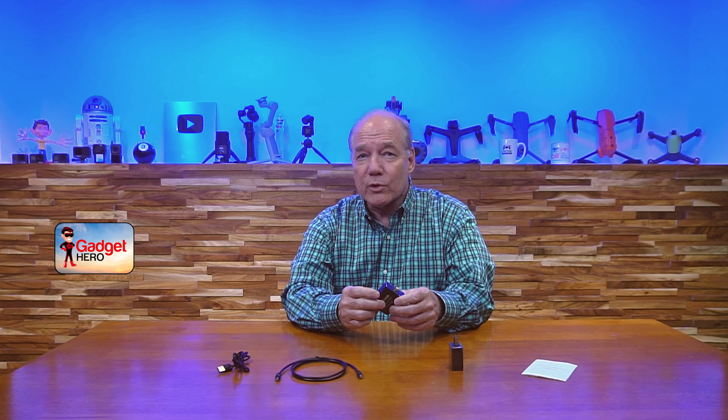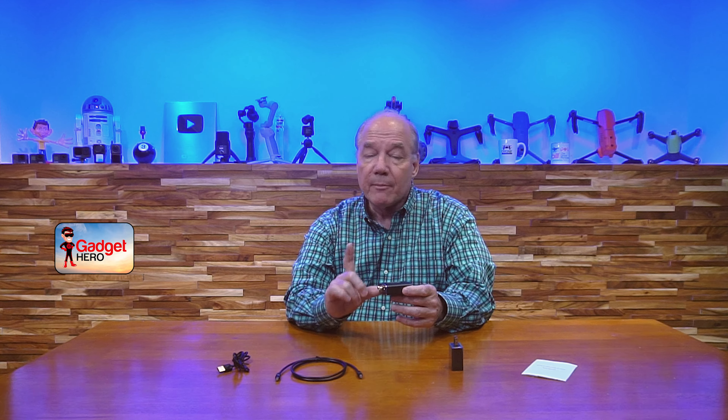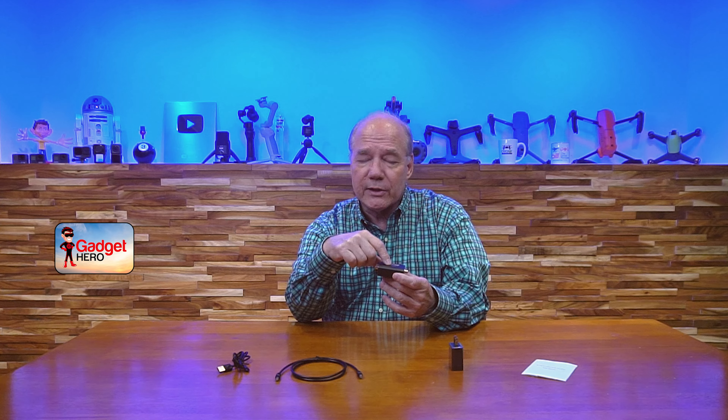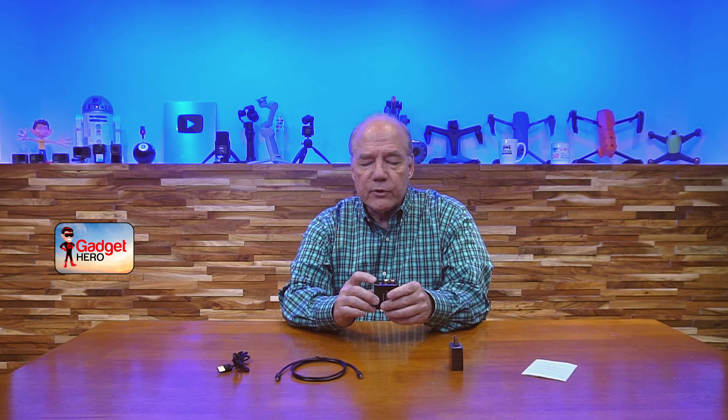This unit has a lot of features you may not find in other products. For starters, it's got an all-aluminum case. That may not seem like a big deal, but a lot of other converters on the market use a plastic case. Aluminum is important for two reasons: number one, it makes it more durable and you don't have to worry about plastic cracking. More importantly, the analog to digital conversion circuitry inside is really sensitive, and an aluminum case helps to minimize outside interference from causing any issues with that conversion.